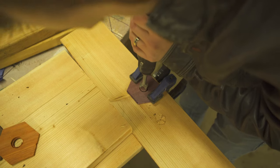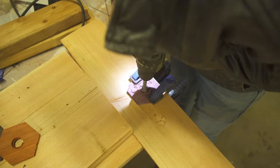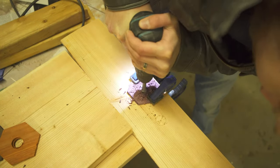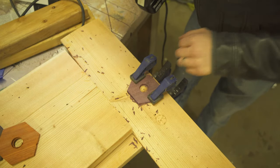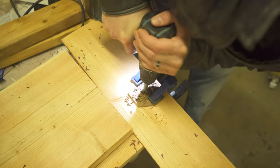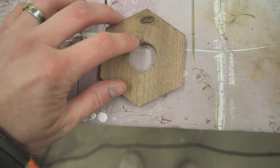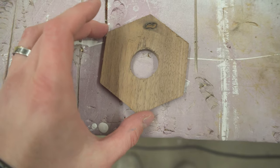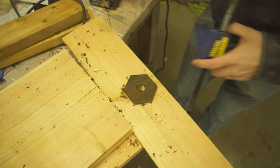You've been watching me figure out how I was going to drill out the holes. I tried a couple different bits, and eventually ended on one that was actually a bit too big, which made me have to redesign the CNC files for the pieces that were going to fit inside, but it worked out in the end. A drill press would have been nice for this, but I did what I could with what I had. If I could go back though, I think I would have found a way to cut out the holes all the way on the CNC machine. I had some problems with blowout on the backside of a lot of pieces, and some of them weren't centered properly — some of them ended up being ovals.